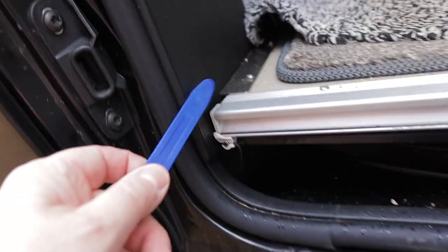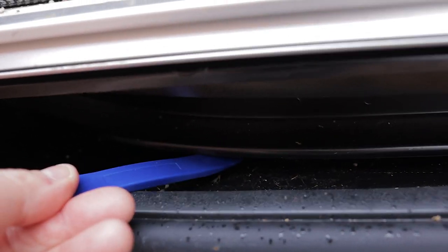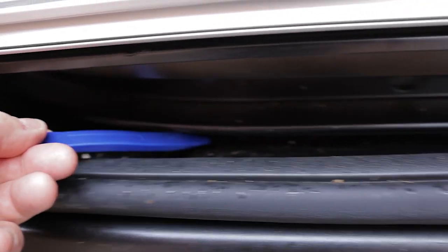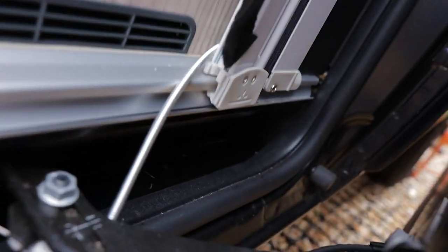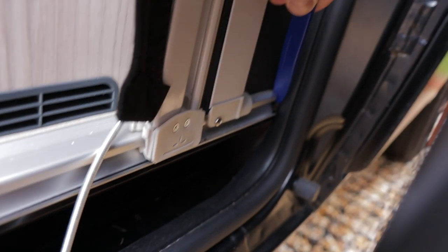I think I'm going to have to take off this bit here, and then the intended route is to go through here, this little hole here, and then underneath this bit of trim here. It looks like the runner doesn't go underneath, so I'm going to need to put a bit of packing under there so the wire doesn't come out. And then you can see I've got a bit of drain cleaner there when I'm trying to find the hole. I'm going to come up the back here and there's a gap here which I'm going to bring the wire through.